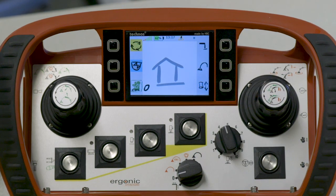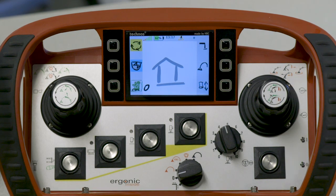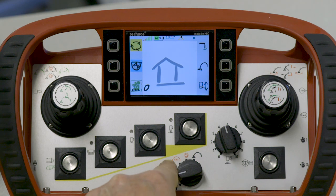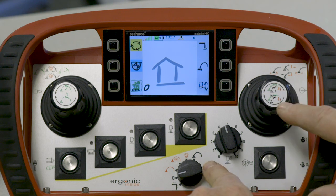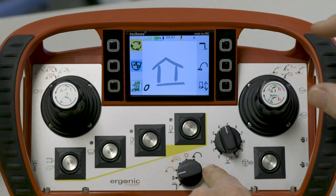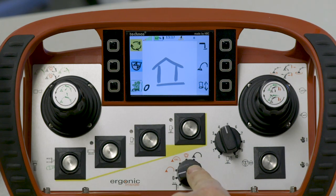One more note when we talk about joystick functions: you'll notice the red icons. When using a machine equipped with the EBC function — whether it's independent boom control, one-stick boom control, or auto fold functions — the red icons alert the operator as to which joystick does what function when in EBC mode. Please consult your operator's manual for the exact functions for joystick operation, particularly with EBC operation.